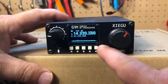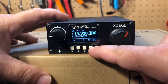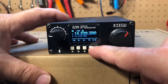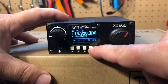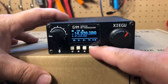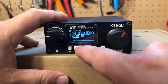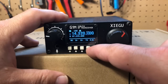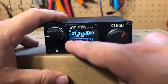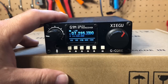This last button on page one is our VFO A and B switching. And if we long press it, it's frequency or channel mode switching, but we don't have any channels selected so we're not going to switch any of those. We don't have to hit the lock/menu button — if I want to A/B, we can just hit the button and it'll go to whatever menu page. But now if we press the lock button again, you can see we have different options — this is page two.